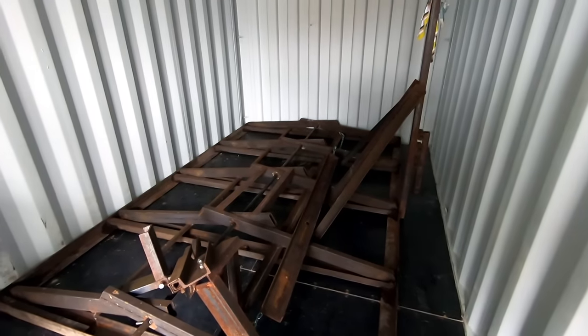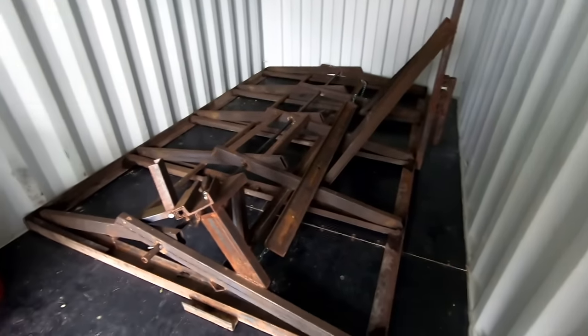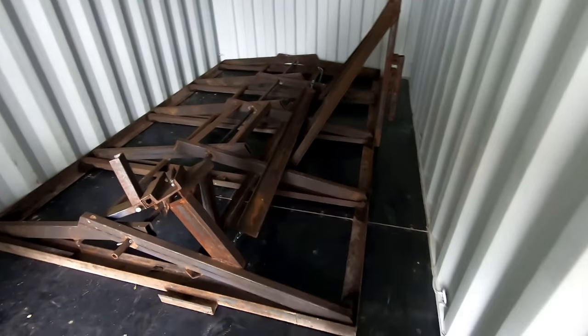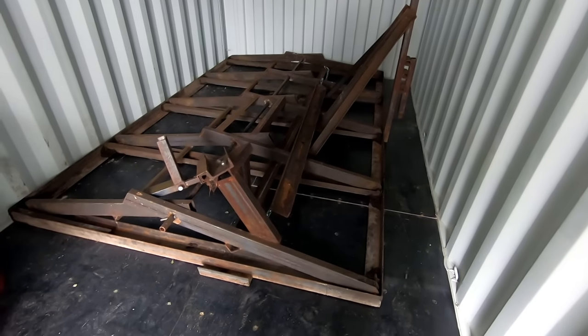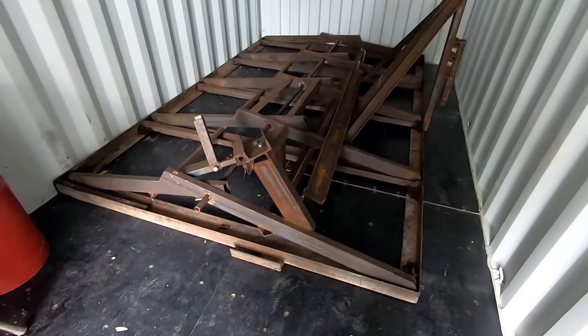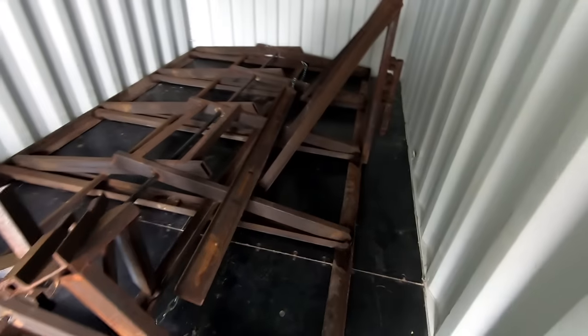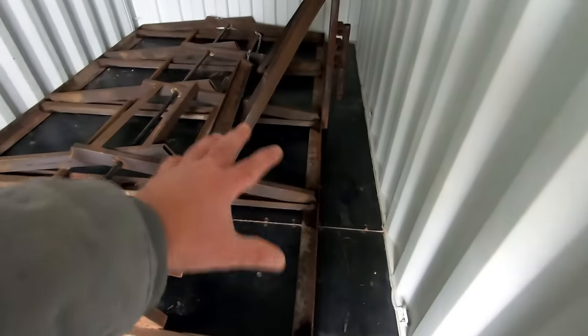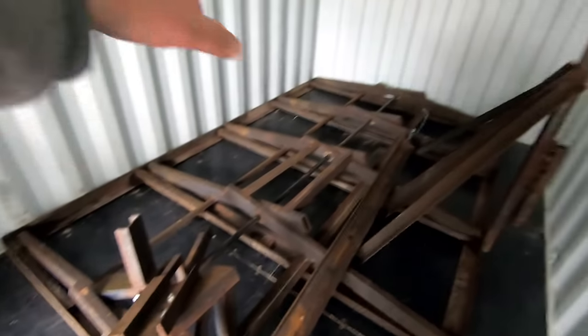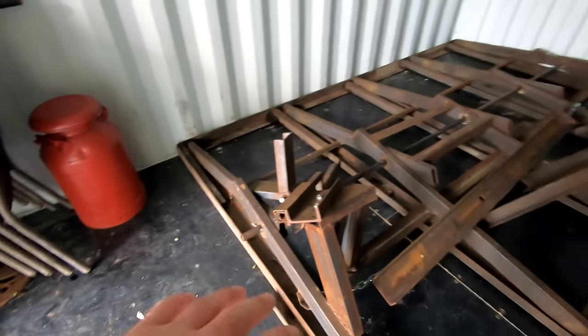It's like a flat deck wrecker. So, you know, we can't put more than 5 tons in here. And this here is probably, if I had to guess, 1,000 pounds. I don't know. I don't work in metal, so it's really hard for me to calculate what the weight is. But what I'm going to do is just screw blocks to the floor to make sure that this can't move around. And I'll actually screw blocks straight over top of these pieces here so that it can't lift out. So anyway, I'll go around and do that in different places throughout this rig.